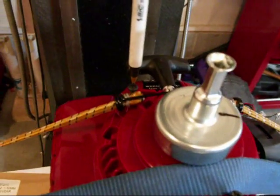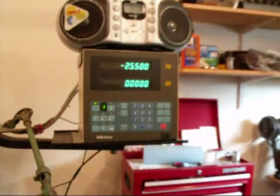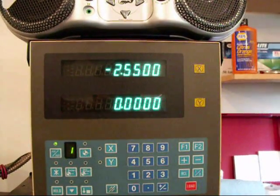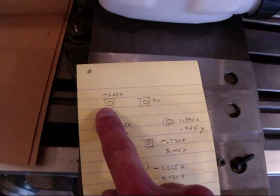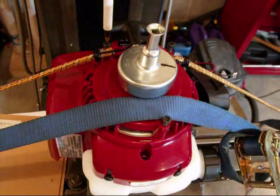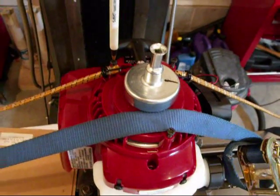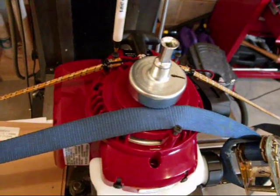As you can see, we're centered over the second bolt to the left — the master bolt. We didn't have to move any on the Y because they're perpendicular to each other, but we can see that on the X axis we moved negative 2.55 inches. So I made a simple sketch with simple notes and did that for every hole. Then I can take this in and compare it to where the screw locations mapped out using the optical method with the photograph. Between the two methods, this should give me pretty good accuracy on where the holes are going to align with the brackets that I make.